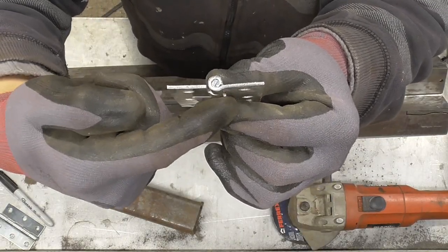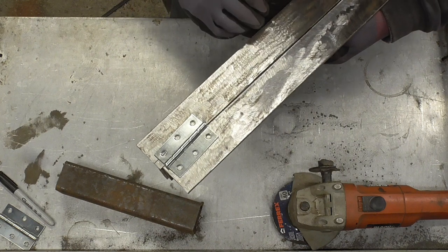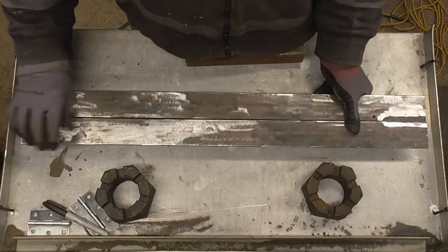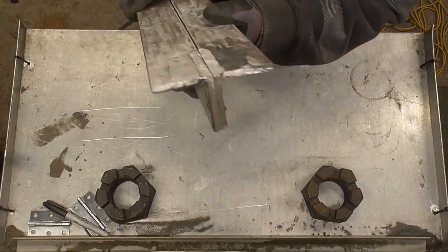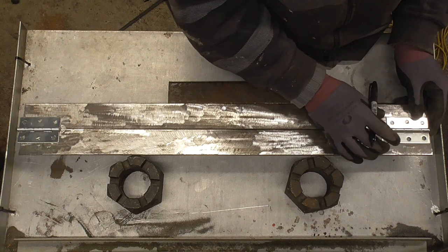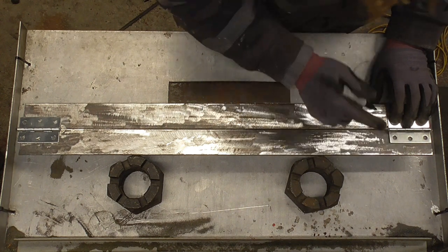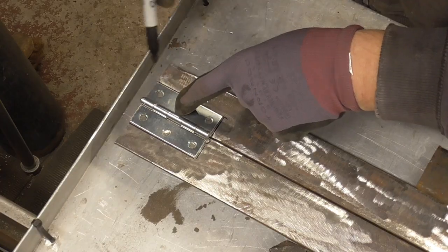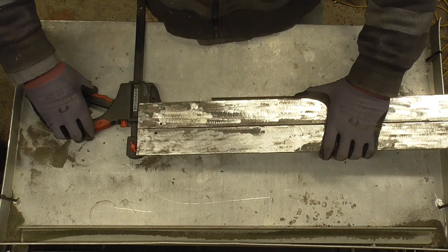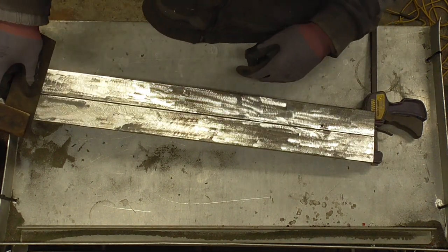Because of the hinges I've used they don't sit entirely flat - slightly rounded there. So I'm just clearing a small amount of metal off this joint here so when we put it on it sits nice and flat. We're going to take our two lengths of angle, put them together and effectively make a T-section from it. We've got our hinges - they're going to be welded on the ends. I'm just going to mark them out centrally so that when I weld them on later it makes it easy to align for the weld. We want to get them perfectly flat so we can put our hinges on.